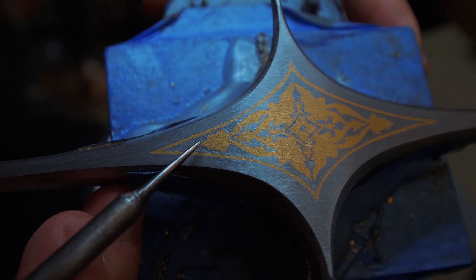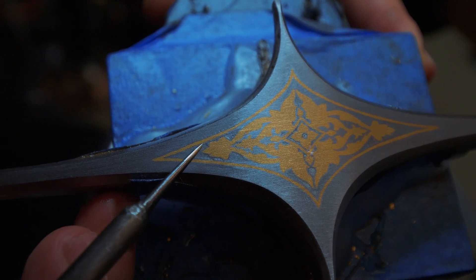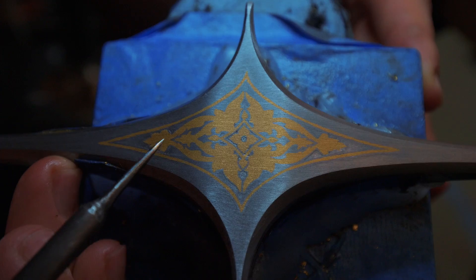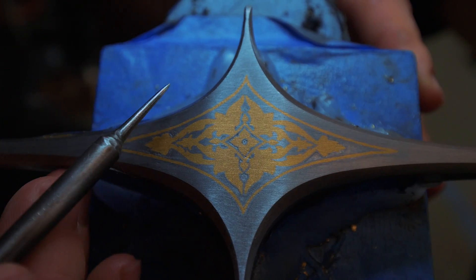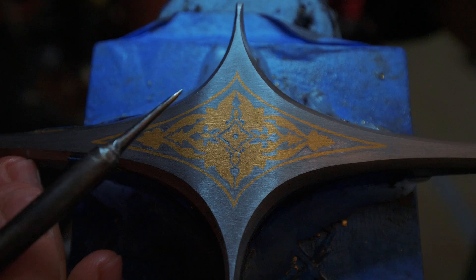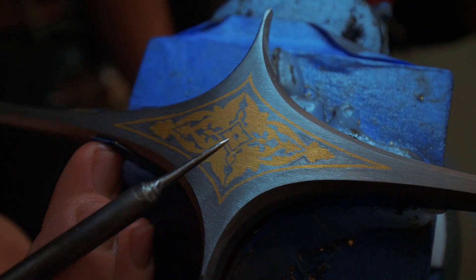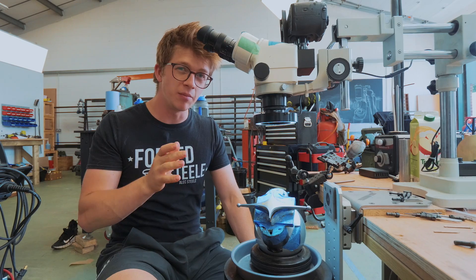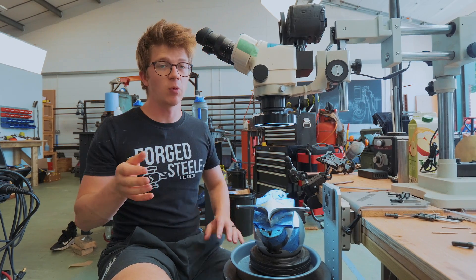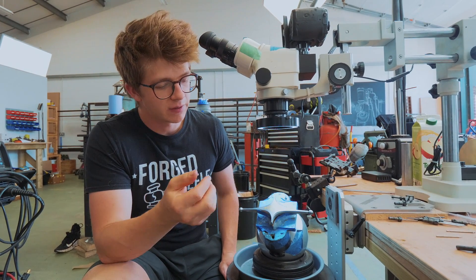You'll also see there are some little shadows around the inlay in certain areas — those shadows are where when we undercut the steel we rippled it up. I'd really like to do as little stoning as possible because the deeper we go the less gold is actually held in there. Looking at this design, it seems I've got to do another step to properly make it pop — and that is to engrave about a quarter of a millimeter to one side of all of the gold, a very neat line. That'll make it stand out and, if we decide it needs it, allows us to have a border for cutting out the background.